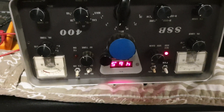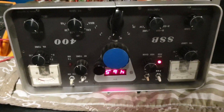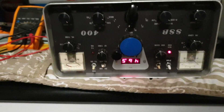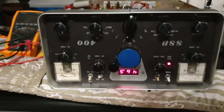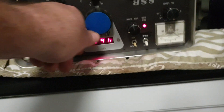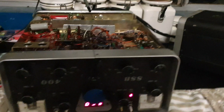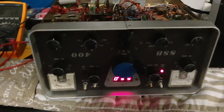It's about 1 o'clock in the morning. This radio had developed a dry joint in the rear section which we were able to get going pretty fast. I was chatting to Travis saying it would be an easy one to get up and running, as he'd had it up and displaying before. The VFO function is actually working quite well. I'm in the kitchen — it hasn't moved from there yet, so I need to get it out to the workshop.